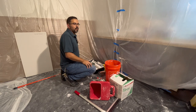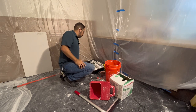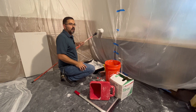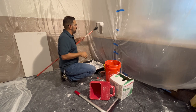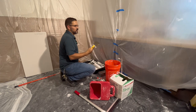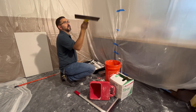I'm going to talk about the tools I used to skim the ceiling. I basically took an 18-inch roller and rolled the mud up there — the consistency was between yogurt and peanut butter. After that I took my 12-inch crown knife and skimmed the ceiling.